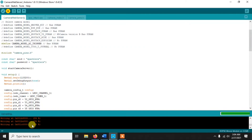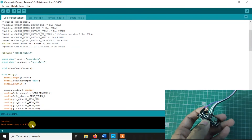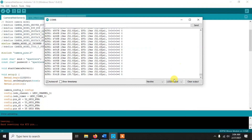If you get a timeout error, try switching from 3.3 volts to 5 volts - sometimes 3.3 volts doesn't work reliably. Once uploading is done, remove the jumper wire connecting GPIO 0 and ground. Then open the Serial Monitor and set the baud rate to 115200.